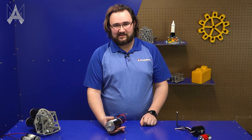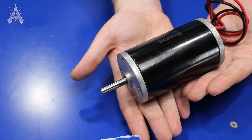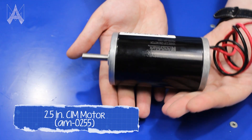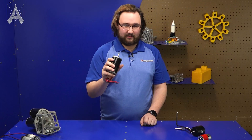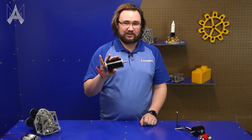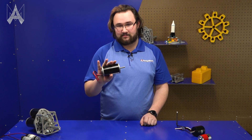The tried and true workhorse of FRC is the 2.5-inch CIM motor. This motor is ideal for high load applications like your drivetrain, arms, elevators, and anything of that sort. It has a lot of power and a lot of thermal mass. It also holds up while it's in a stall condition or when it changes directions quickly, which not all these motors handle as well.